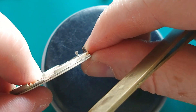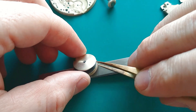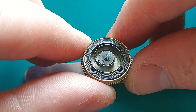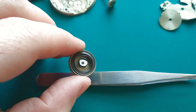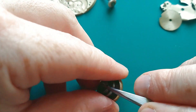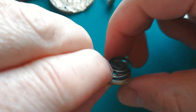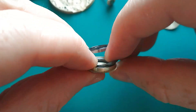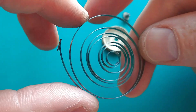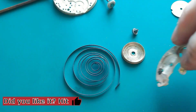I will clean it and it will be like new after service. Here we see quite a lot of rust — I will use WD-40 and this should help. What's left is to take out the mainspring from the barrel — it's quite easy. Here is also very dry oil. The watch was working, which is a sign that the previous service was quite good, but it has to be repeated. The mainspring — after this many years it should be replaced, but I don't know if I have a spare, so this one will have to stay.